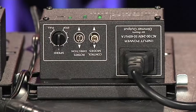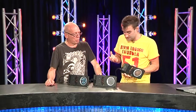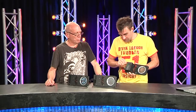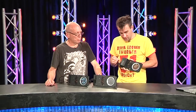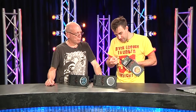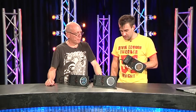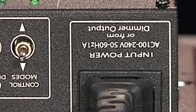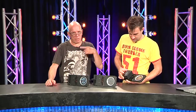The Simple units are mains powered and non-DMX controllable. It's very much as it says on the label — a very simple spinner. You can adjust the speed with a knob, a little potentiometer, and you can change direction forwards or backwards, or flip it into a mode called dimmer. Right now it's running full speed because we're feeding it straight 240V, but you could plug this into a dimmer and adjust the voltage coming in, which would adjust the spin speed. So as the light gets dimmer, the effect gets slower.